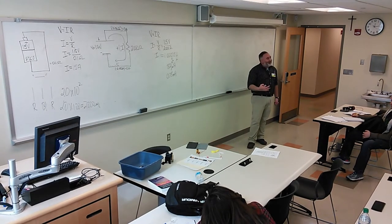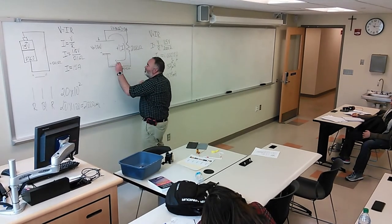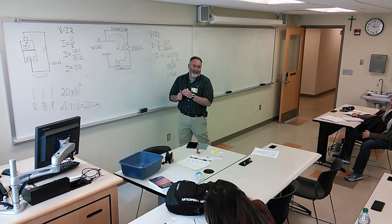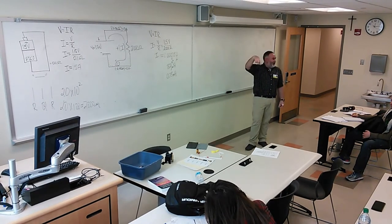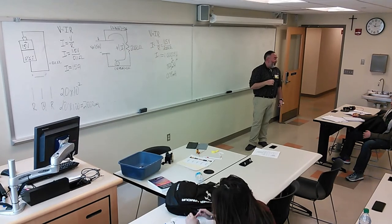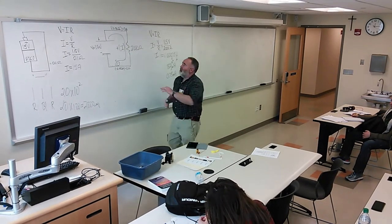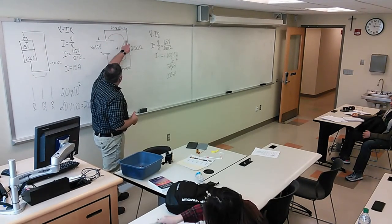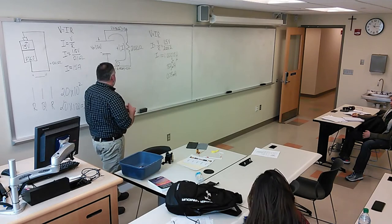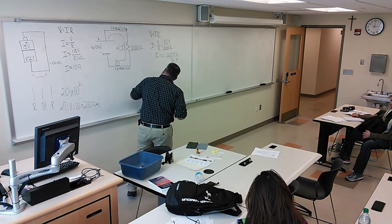Capital I is considered positive current. It also allows us to talk about electrons. So when we're specifically asking which direction the electrons are flowing, then we can go back to them flowing opposite, as if the electrons were falling up. Apparently that wigs people out. So here's our positive current flowing away from the positive and then down to the negative. This keeps the engineers happy, or the engineers I can make fun of.